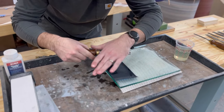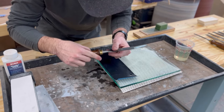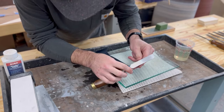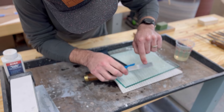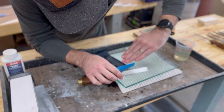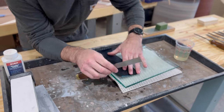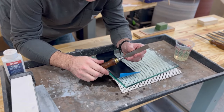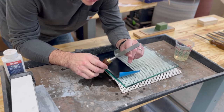If we look at the back after cleaning off the water, we can see we're making progress on getting it flat. I'm looking for the heavy grain lines to disappear out of the matte finish I'm creating. I can still see them towards the center, which means the edges were a little high compared to the middle. We're going to keep going until those disappear. I'm confident that is now a flat surface, so we'll move on to the Sweetheart chisel.